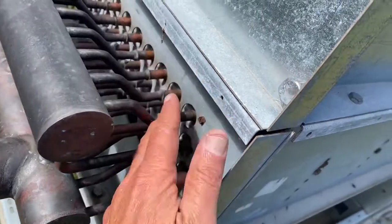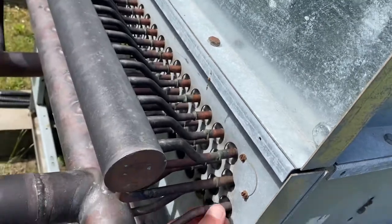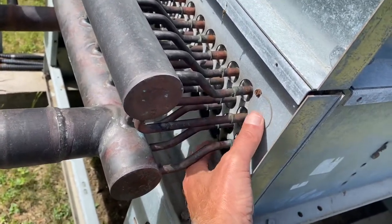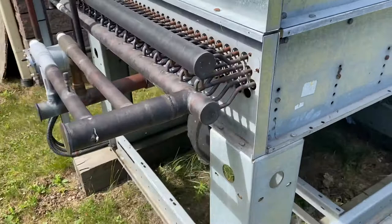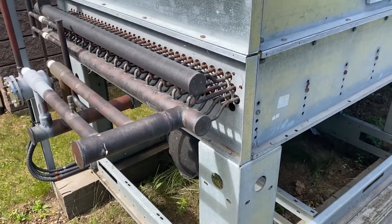This is a tube sheet here — the tubes go through it. They make these differently now; this used to be solid. In earlier years, the expand-contract cycle would actually rip these pipes right apart. So the last fan had to run all the time. Now with variable speed, that doesn't happen anymore — new technology has actually helped control these a little bit better.